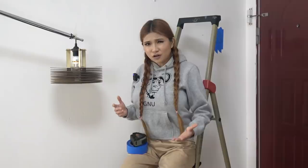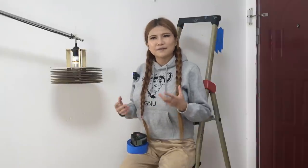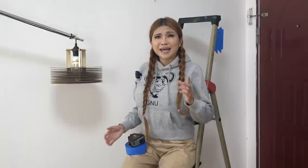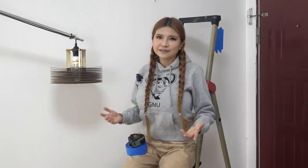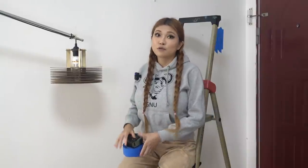The maximum size room this should be installed in is 4 meters by 4 meters. Anything larger than that and the light will probably hit too low and you won't have sufficient power to treat the air in the upper part of the room. For safety reasons I kept the fixture pretty underpowered. Ideally the fixture should hang at or near the center of the room — you then measure the distance to the nearest wall, and that will tell you the minimum height to the bottom of the fixture to keep the UV well above everyone's head. Higher is safer and better. We can figure all this out with a ladder, some painter's tape, a tape measure, and the fixture with a white light inside — perfectly safe.